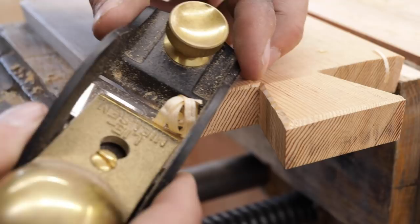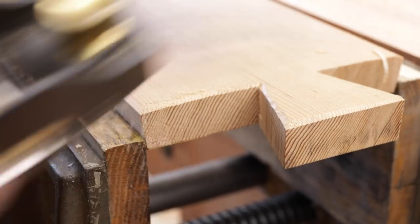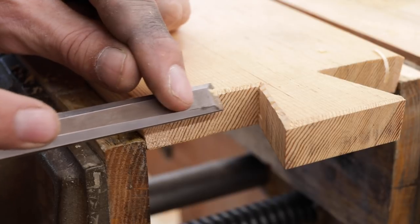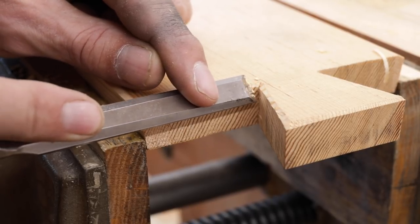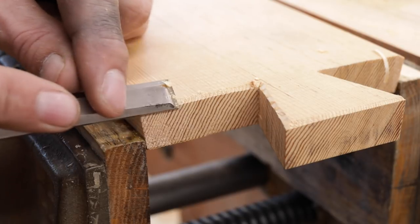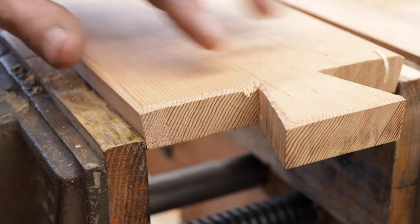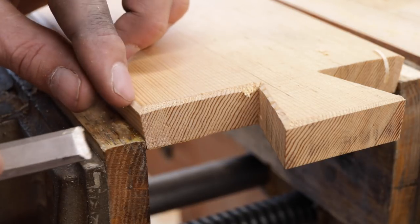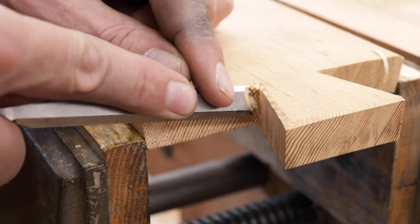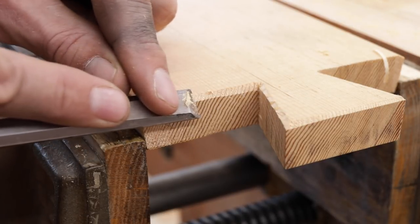Over on this side we have a bit of a challenge because you can't get your plane in there. Whenever you can, even if it's just a little bit, get it started at an angle so it matches up with the other side. Then we can do this by hand. Try to avoid sandpaper on this one — we want those hard lines. Sandpaper destroys the tool marks and rounds everything over, making it look common. It's so important to have your chisels sharp — see, we've duplicated that angle freehand. The pleasure of working with a sharp chisel is hard to quantify — you can't get this look with sandpaper.